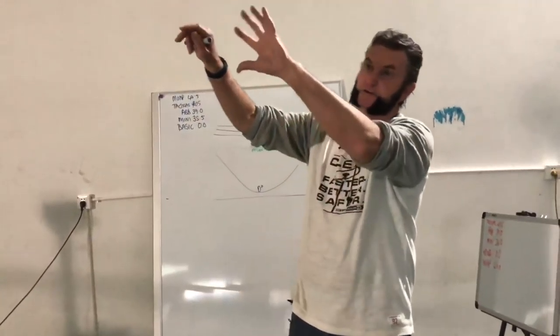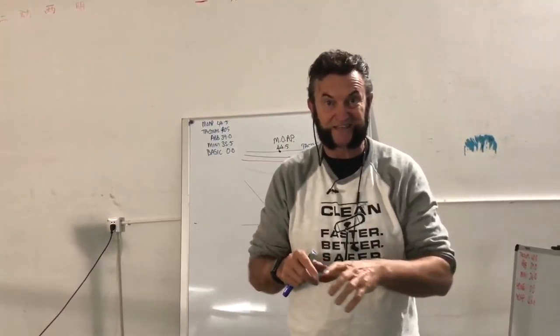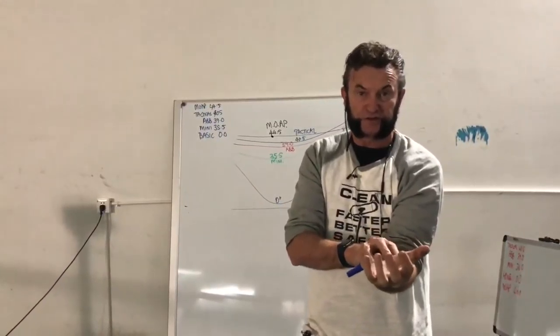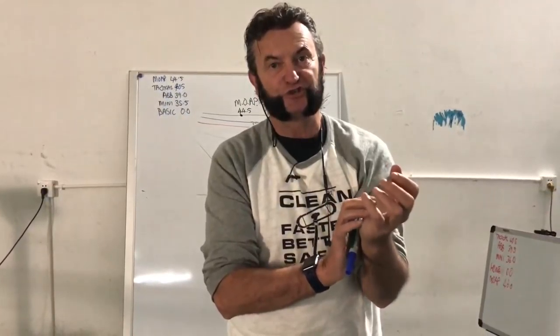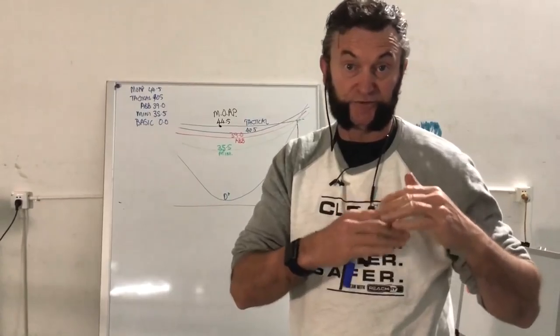And at the top, the brush is going to spin. Now, if you're doing that and your pole is flexing, so you try to put a constructor brush on top of a basic pole, the pole's going to be like this, and as you turn, the pole's going to corkscrew. It's going to load up your wrist, right? So the basic pole is not even potentially injurious. It is injurious, right? It's not a rigid pole. It's dangerous, and it shouldn't be sold to window cleaners, to professionals, right?